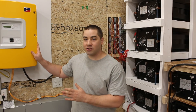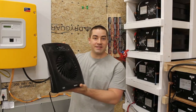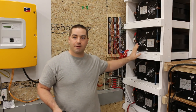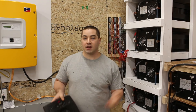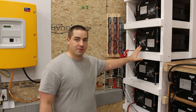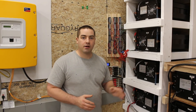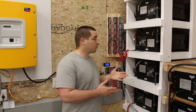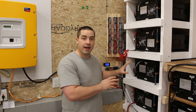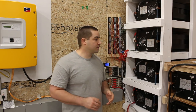The inverters charged the batteries up to 56 volts. Currently I have it connected to a space heater as my load and I am slowly discharging the pack — pulling 800 watts, which is about 15 amps on the battery side. Now let's talk about the conditioning process. These batteries sat over a year in a warehouse before I got them, so I don't know their condition. I want to be very gentle as I start the charging and discharging process, using very low amps.